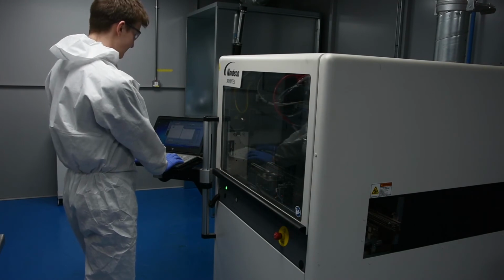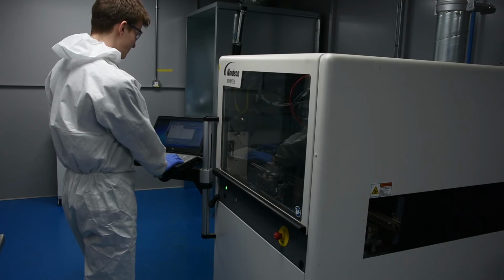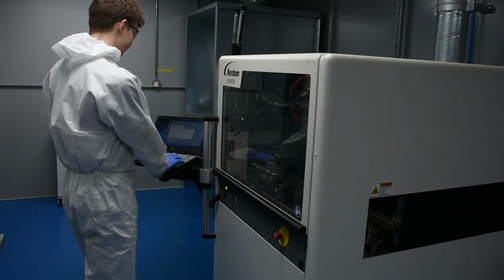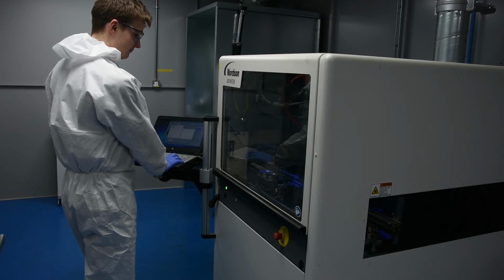By allowing a don't care area between coated and uncoated sections, you can avoid potential problems such as capillary action. The downside to this method is that it requires a more sophisticated operator to run the machine, and it is not always easy to achieve good coverage of sharp edges. Programming can also be time-intensive and require machine downtime, which can limit the appeal of this method in low-volume, high-mix production environments.